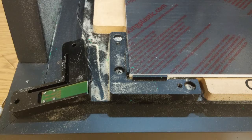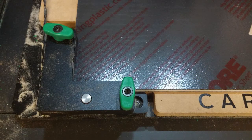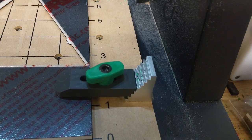The first thing you're going to want to do is completely remove the clamp. You should line the material up to the two ridges that are sticking out. Next, you want to put the smart clamp atop the material that you are trying to carve out of. Screw on whichever knobs you choose to use, depending on the thickness of your material. Then put on the small aluminum pyramid pieces and line up the clamps just like that. Make sure to tighten all these to just finger tightness. No need to use an Allen wrench or a drill or anything like that.